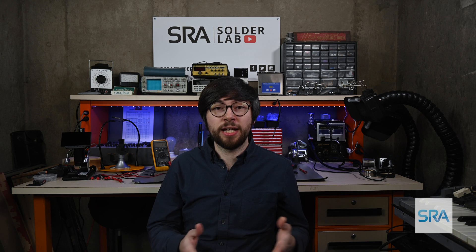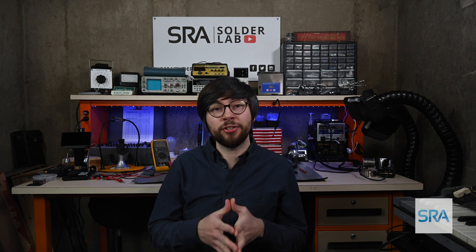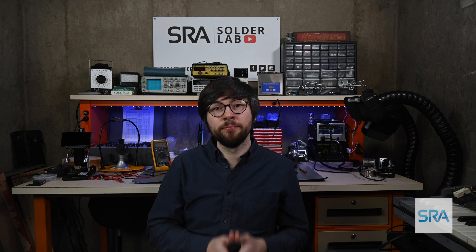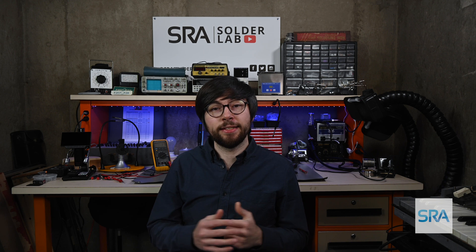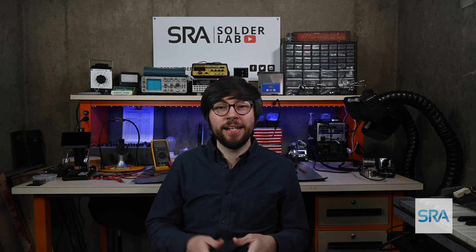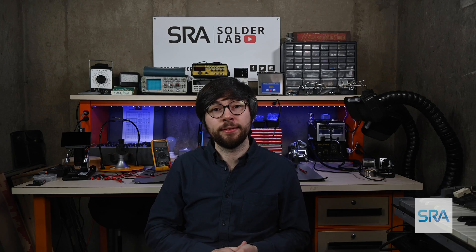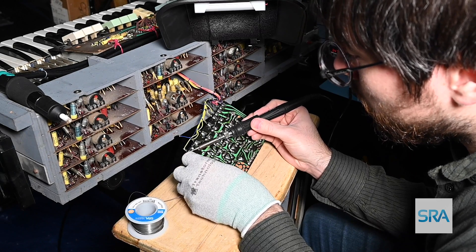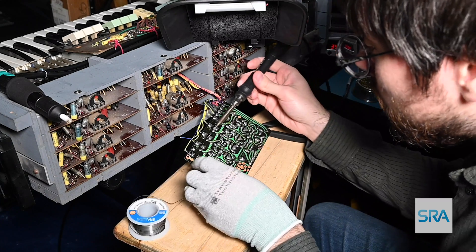So what about the fumes? The good news is that soldering fumes do not contain lead. Inside of your solder wire there is a core running throughout, and this contains a chemical called flux. This is what allows the solder to actually adhere to the workpiece and make a strong mechanical connection. When heated on your iron tip, the flux starts to smoke and that's the fumes you're seeing. Rosin core flux is the most organic type and actually doesn't smell too bad. But make no mistake, you really don't want to be breathing in these fumes whether or not you like the scent. It is important to solder in a well-ventilated area, and we recommend using a fume extractor to direct fumes away from your face. When you're looking over your workpiece and you breathe in, the fumes will naturally run directly into your nostrils. The fume extractor solves this problem by creating a stronger suction to pull them away in the opposite direction, minimizing exposure and making for a much safer soldering environment.